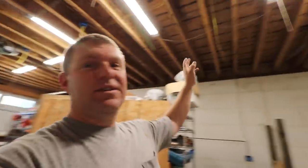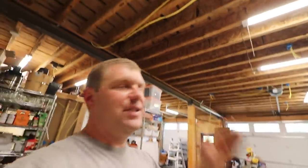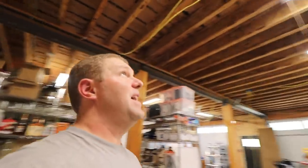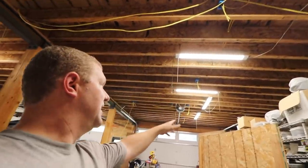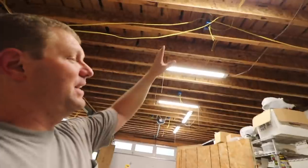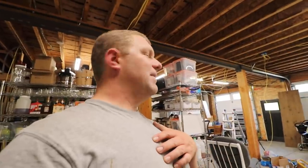I think I'm just gonna focus on getting the wire secured, like this droopy wire right here that's hanging down. Work on getting all these laterals secured up to the joists. And then I'll probably start working on getting these outlets in these pigtails that are sticking down. That'll tidy that up and get those things secure. That's probably going to give me at least an hour of work, minimum. That'll give me time to let the paint dry.